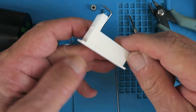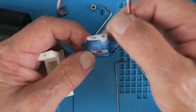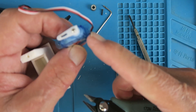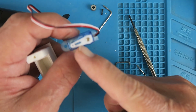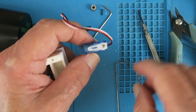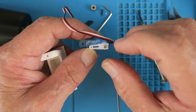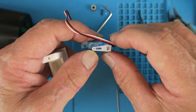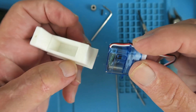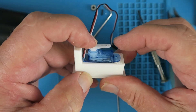I don't think there's anything much more I need to do there. Preparation for the servo itself is simply clipping this end off to length and drilling out — it's about a 1.4mm drill. Drill out the holes and then join them together; what I actually ended up using was a very tiny fretsaw. You then simply pass the servo cable up through there and the servo itself fits neatly into there.